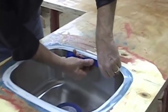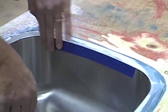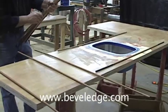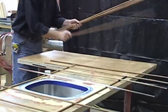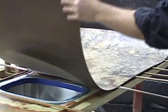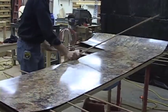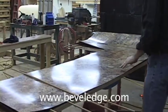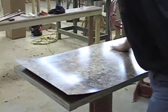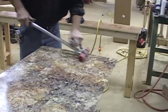Wipe clean and apply a band of painter's tape to the inside rim of the sink — this will help protect the sink from excessive epoxy squeeze out and contact with the router bit bearing. Mix and apply a small bead of epoxy around the sink. Now place dowels or something similar on the deck spaced every few inches; this allows you to place and align the laminate before sticking it down. Align the laminate to the deck and remove the dowels starting at the center and working outward.